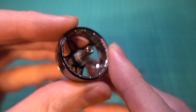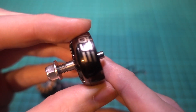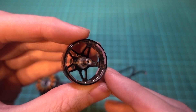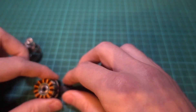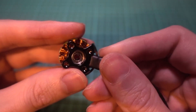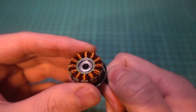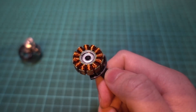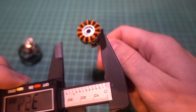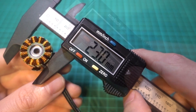It's either that or balanced perfectly, which is never the case. So if you don't see this material on a motor then it's more than likely not a very good quality motor because they haven't gone to the extra length of balancing it. Something that can determine the quality of a motor are its bearings, which used to wear out on budget motors but that's not really the case anymore either - it's just something to watch out for. You will hear a motor sounding noisy when it spins rather than being smooth. The stators are listed as two measurements in millimeters - the first one is the diameter and the second is the height.